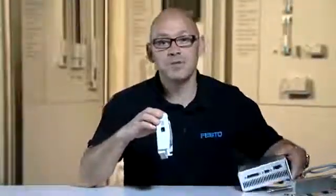We've taken our popular servo light controller, improved the performance, reduced the size, cost and power consumption, to produce the CMMO controller, specifically designed by Festo for our new range of actuators. With features such as safe torque off, integrated inputs for referencing and ethernet diagnostics, this compact controller really does pack a punch when it comes to time and cost saving features.